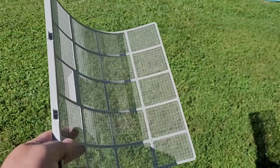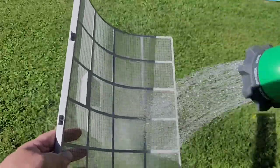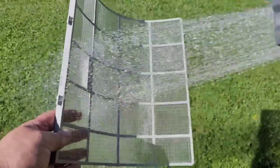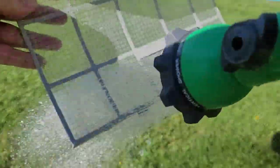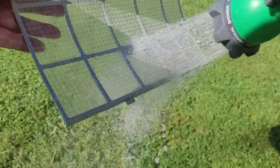Since I'm cleaning the outside condenser, I also take the time to spray out the inside filters or replace them depending on the unit. I do this once a month anyway so they're not that dirty, but now they can dry out in the sun and be ready when I hook the system back up. I typically vacuum mine out, but since the unit is going to be down for two hours anyway, it's a good time to spray them.